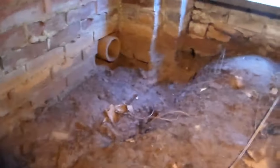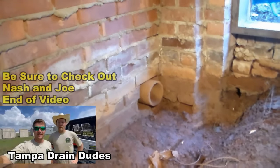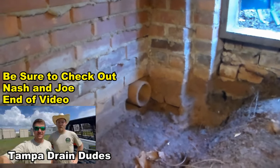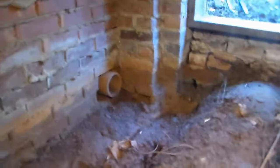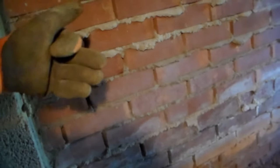If you look carefully over there, you'll see a core. There's an old terracotta pipe that runs through the wall right on top of the foundation, actually about a brick above. Water has to flood up into that pipe before it can discharge. You can see how muddy it is. We're going to put a sump pit right here, a sump pump down in there, gravel all around the pit, and go right through this brick wall for discharge — we'll drill back through the brick. So let's get started.